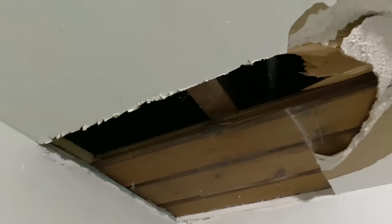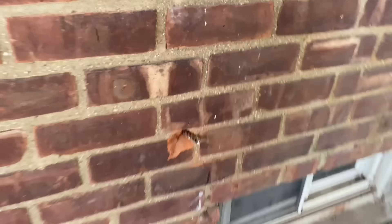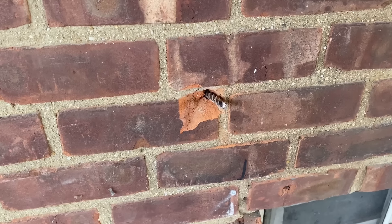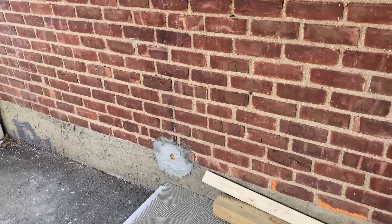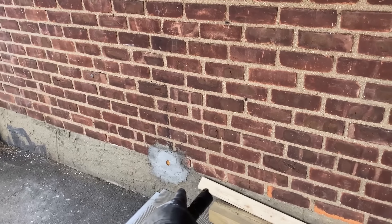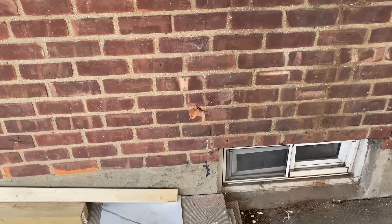What's crazy is that I've got to put a dryer in the corner with a dryer vent. No idea why they put that ceiling up there — that is nuts. Just continue cutting there and I'm gonna drill a pilot hole outside, then we'll drill through the brick for the dryer vent. I busted a hole with a pilot bit from inside to outside. That could have been an old dryer vent, but it's half in the foundation — with that hole we're about four feet away from where we need to be.